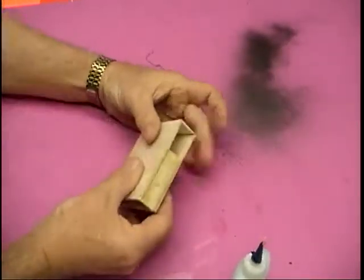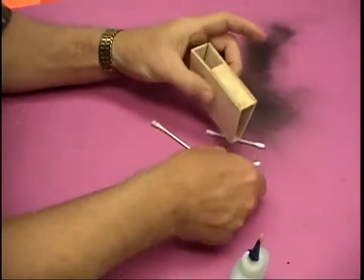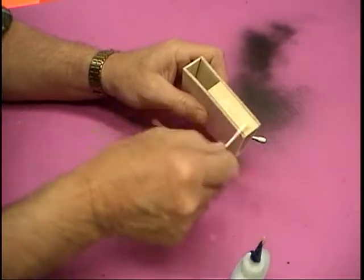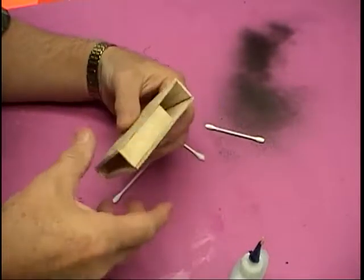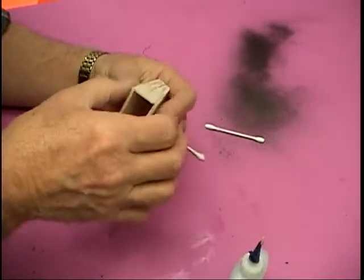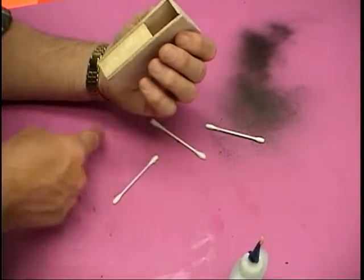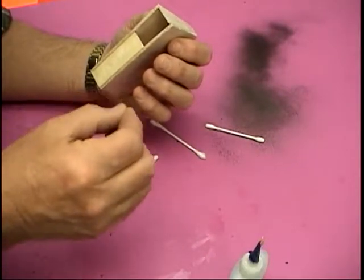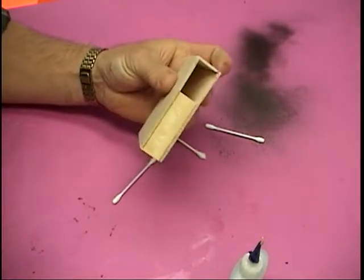Now you notice a lot of parts of this. We have a part that acts as a jig, as a fixture, and later on gets cut out of the plane, or in this case it gets moved, gets fine-tuned. It's that sequencing of parts that once you have that down pat, it's just a production job. But in the beginning, when I was figuring this out the first time, even though I had seen Casmanato's plane, I said, does that go before that? Or do they put that screw in there? So that sequencing, if you just go step by step by step, I think you have a big advantage over somebody just throwing darts in the dark.